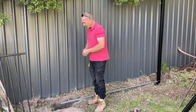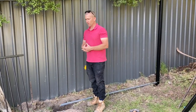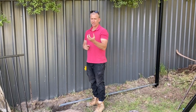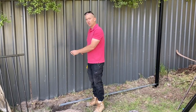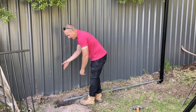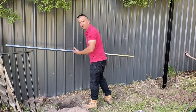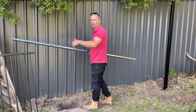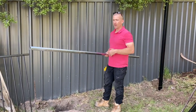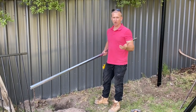I like to use a bit of paint. You've got to remember that you've got a 50 by 50 post as well. What I sometimes do is use a spare post cap and put that in between the rail. You put the post cap there, mark it first, put the post cap there, then pick this up and run it over to the other side of the post cap, and keep continuing that on, marking where the holes need to be dug. That way, once the holes are all dug, you're pretty much going to be in the ballpark of where the posts need to go.